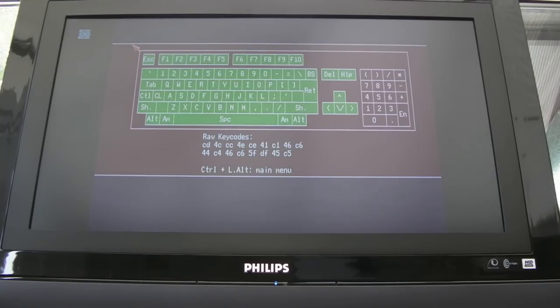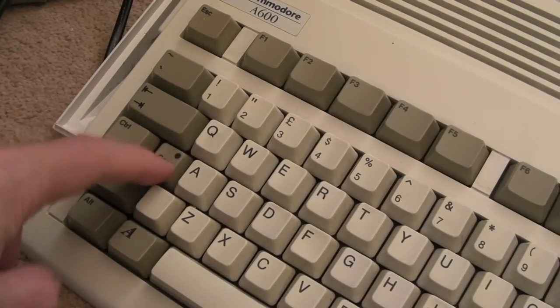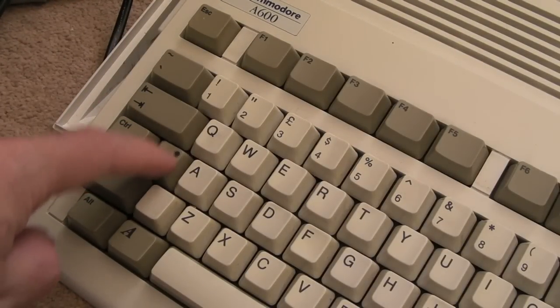And then I noticed that if you power it off, let me just see if I can recreate this. If you power it off really quickly, more often than not, you'll just get a boot or a black screen. And at that point, the keyboard doesn't work. Let me show you this. So we're still on a black screen here. It's not working. Yeah, the caps lock LED does not go off and on.